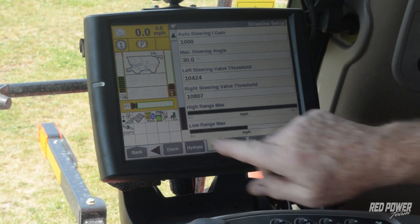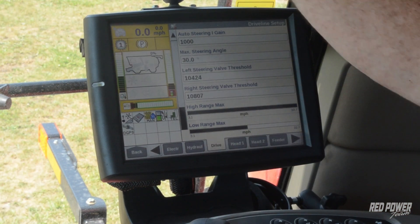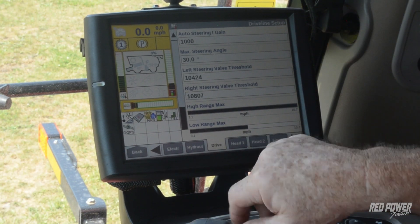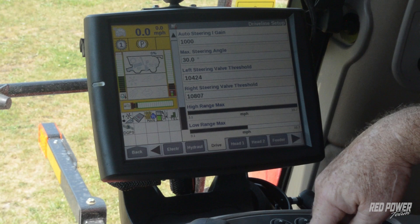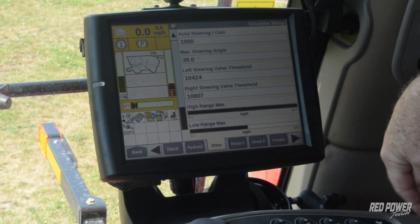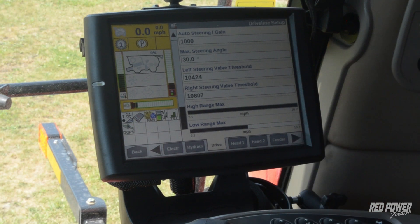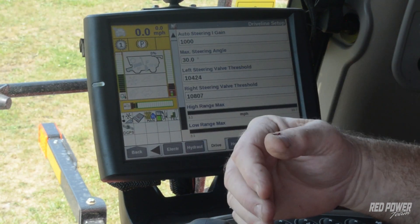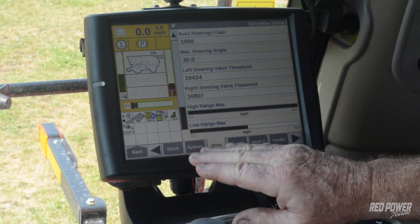One nice use of this high-low range feature: let's say you're pulling out on a headland and you've got to run down to a truck to dump — cart's full — and you're already sticking ahead going 7.5. Rather than adjusting that range again, simply toggle between low and high side and it'll take you up to 10.7. It's a handy feature with the two-speed transmission. You can simply toggle back and forth to get your speeds. If you go the other way — sticking ahead at 10.7 and you toggle back to low — it is going to slow you down somewhat abruptly, so just be aware of that. Very handy feature on its own, but again separate from feed rate.